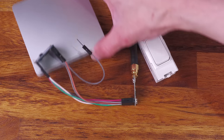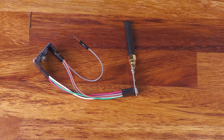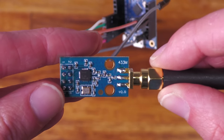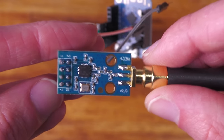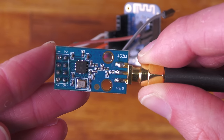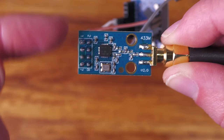For this we need a receiver that can receive 433 MHz radio signals with FSK encoding. The particular one I've gone for is based around a chip from Texas Instruments called the CC1101. These are available from lots of different brands - even though they all use the same TI chip, they come on lots of different carrier boards. The specific module I've gone for is the E07M1101D from a brand called E-Byte, though there are many alternatives.